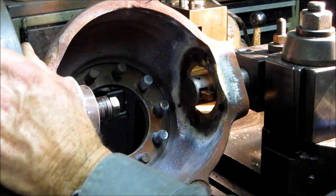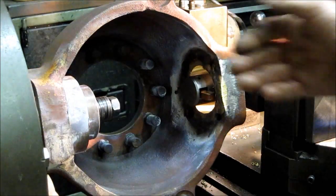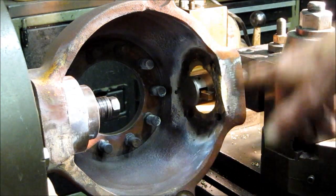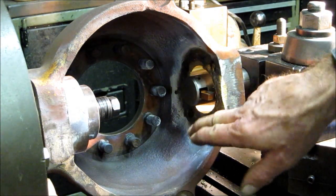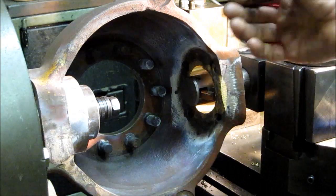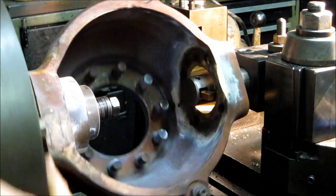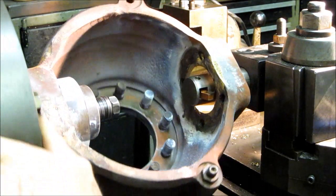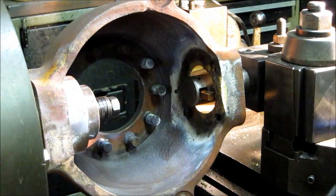We've got a tool bit set up in here and we've got it angled in so we can come in, touch, and then take a straight-out cut. All we want to do is make sure we have a straight landing that kisses the majority of the face there, and then we'll hand grind into that flat — just so that we have a square on the edge of the bore to resemble the original face. It was just a cast face, but we want to make sure he has maximum room in there. We know it was rubbing when the thing was malfunctioning and we want it not to rub now.